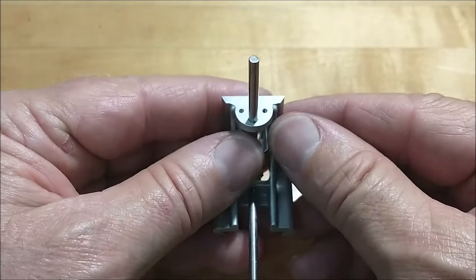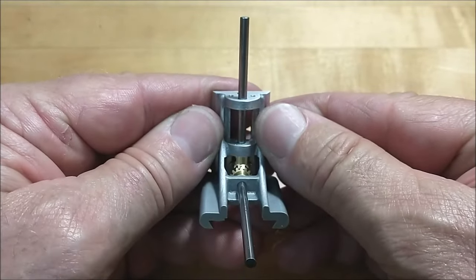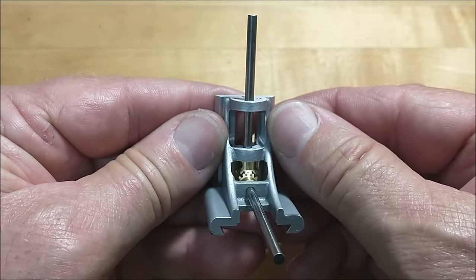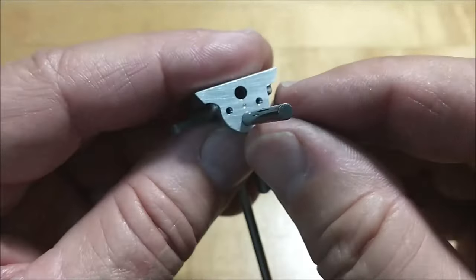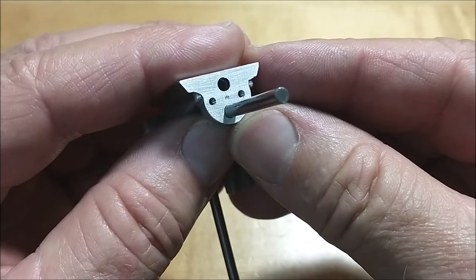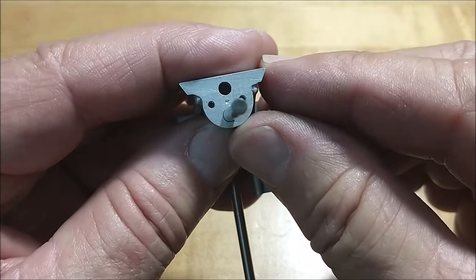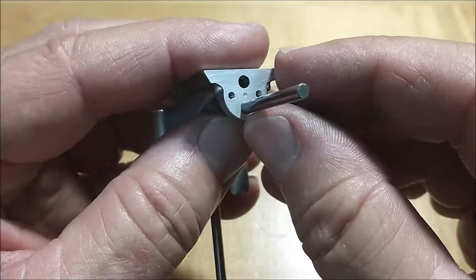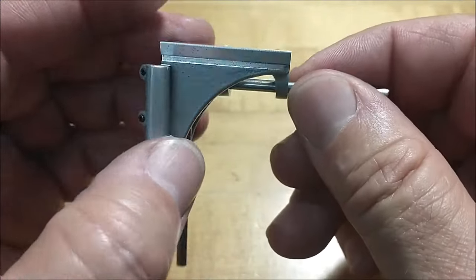The hole you can see is just a little bit off center to the round feature. You want to see how easy that is to fix? There it is. Now it's perfect. Anyway, the only oops on this entire part is that little dimple right there in the center. You can see it. I almost drilled the second 125 hole at that location, and my little internal alarm just went, whoa, whoa, whoa, don't do it. So I will probably fly cut that off and deny it ever happened, but that's yet to be seen.